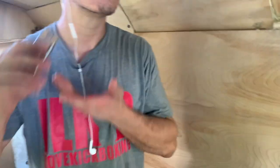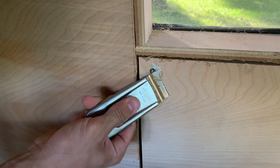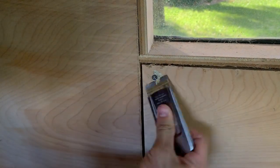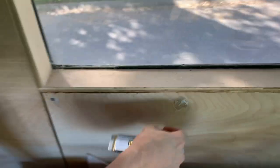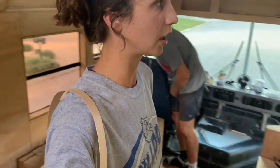It takes a lot of sanding, but it does look okay. Check out over here — it starts to come off but it takes a really, really long time. This is what we were kind of shooting for. So this is what we've been using the razor for — just kind of slowly and meticulously getting this glue off. And then once it gets to about where we're at now, you can get most of it off with the sander. Obviously this has pretty much doubled the amount of time this is going to take, but that's all right. Now I'm going to go around with some more of the veneer and put it on the edges of stuff. I think we're going to go with the thicker strip on both sides just so that it looks a little more consistent.